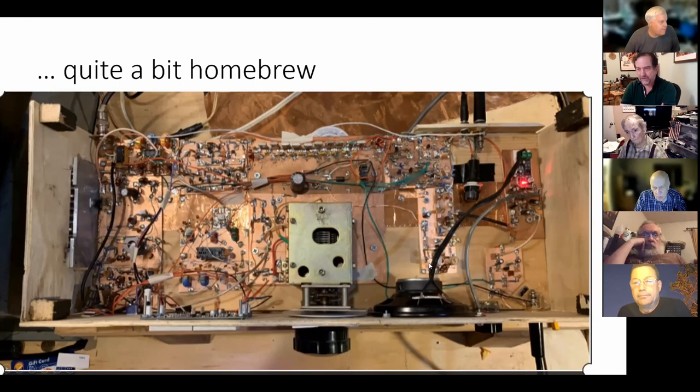Now, as you guys have found out with your rig, when you're setting it up, the placement of that carrier oscillator or BFO in relation to the passband of the filter is critical. This is what determines whether the rig sounds good or not. A lot of times you'll hear guys fooling around with BitX rigs say, oh man, I built it and it just sounds terrible. It sounds awful. And then you ask them, well, how much attention did you pay to the placement of the carrier oscillator frequency in relation to the passband of the filter? And you find out that they figured that whatever came out of the box was okay. They didn't spend a lot of time on it. Whereas if you do that, it'll pay off a lot.